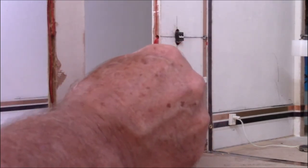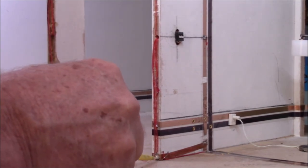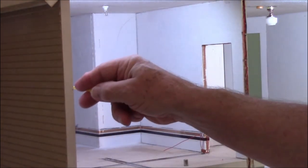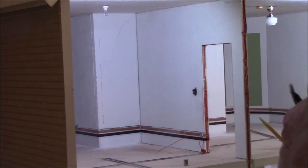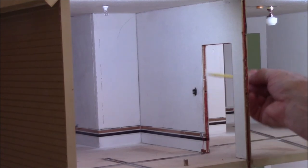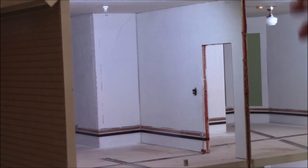The ones that are down here, the common one that I tied two of them together, came all the way down to the bottom, and we soldered it to that point. The other switch on the left side here was to turn on the sconce that's there, which was soldered to this point down there. I can cut that wire. The one for the light in this room comes out and goes up, over, and down through the hole that we drilled from this side, and then ties into the strip up on the ceiling, so that we should be able to have everything in line.